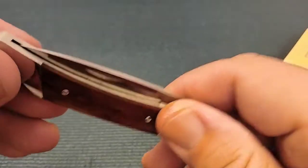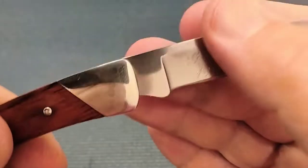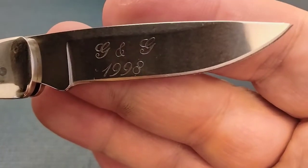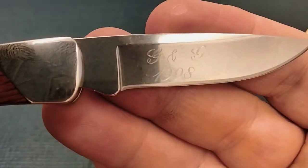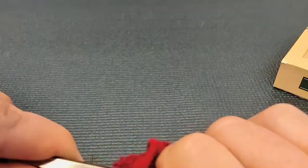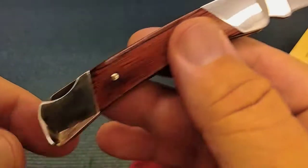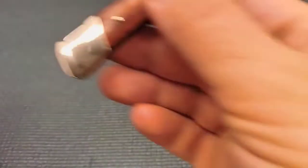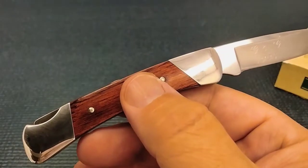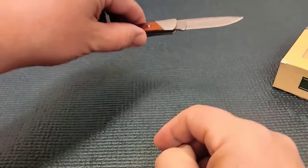It's 420 steel, I almost have to imagine, although it's not stamped. But 420 steel has 13% chrome. And D2 steel — I'm going to talk about this — I don't see a speck of rust on this, being exposed to some temperature changes. No speck of rust on here. No rust. At 13% chrome, if it's 420HC. And I've been complaining about D2, but I'm not having my D2 rust. D2 is a semi-stainless because it's less than 12% chrome. Maybe D2 is not that bad after all — that's the point I wanted to make.